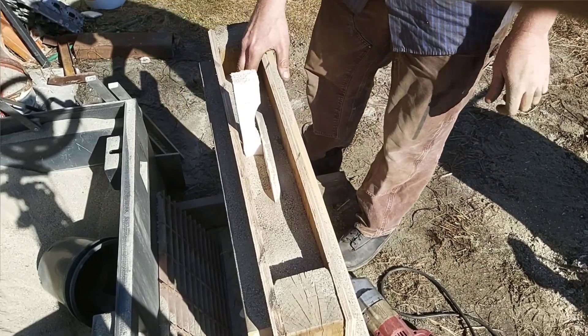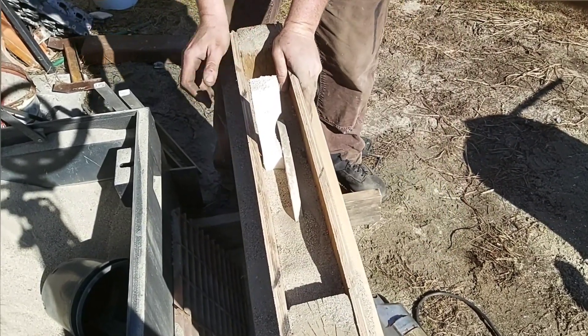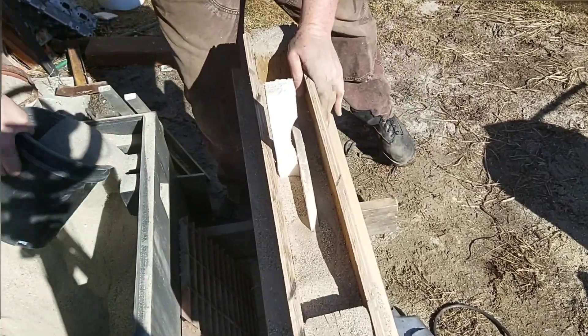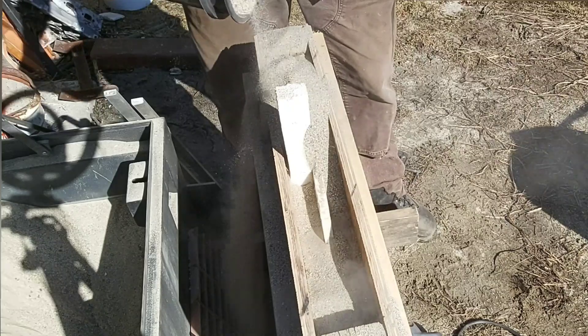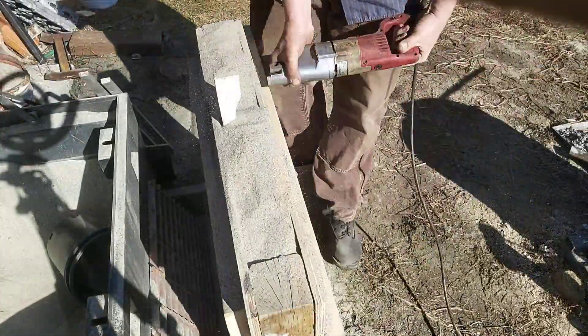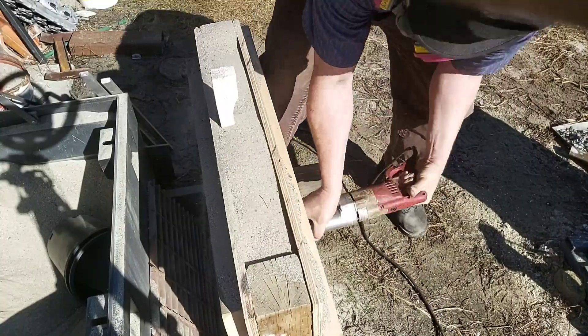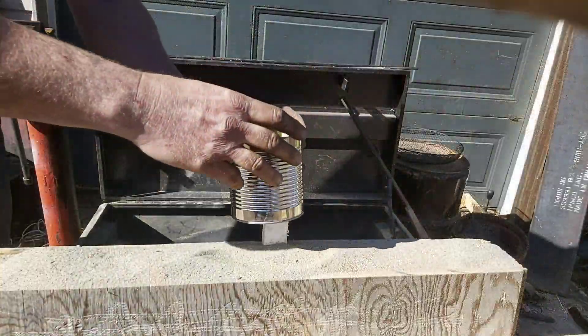Now that I've got it vibrated down and it's about 90 percent full, I've got a really good feeling about this — everything's looking pretty good. That sprue is a little bit close to the plywood and I'm not overly happy about that, but in the end it doesn't end up being too big of a problem. The problem I have in the first casting stems from something totally different, and we'll get into that in a bit.